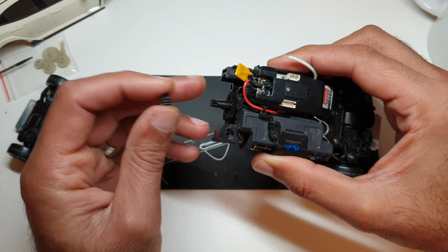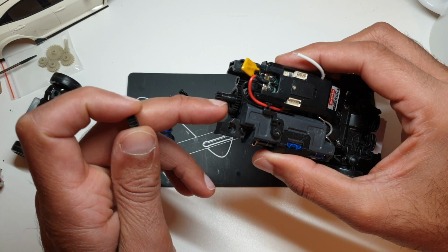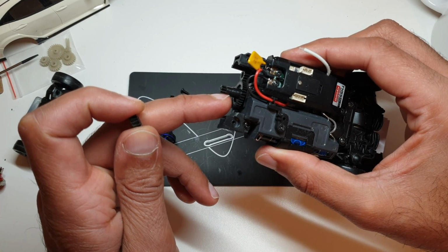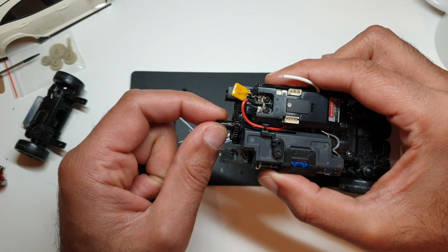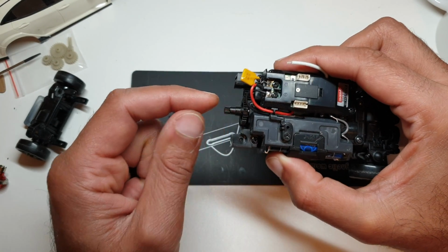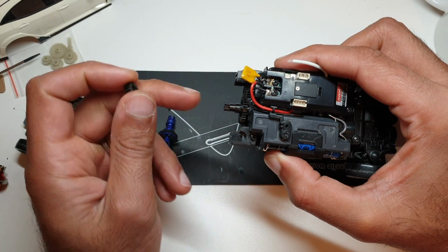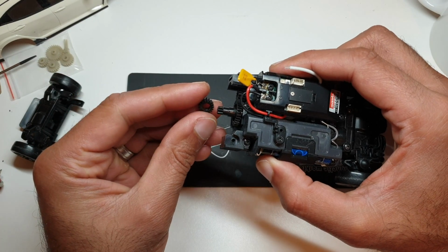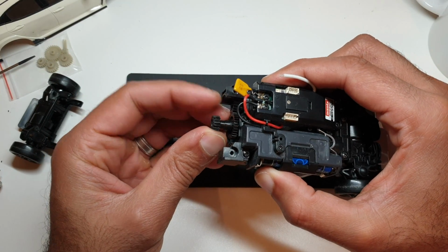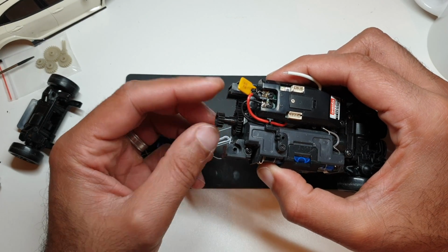The reason I wanted to fit over this main gear is I don't want to cut this gear off, because the axle that connects into here is what decides which engages the axle and makes the gear turn. If we were to chop this gear right down and try and glue this on, then the axle inside would spin. It's less work and easier to do if we can just get the gear to seat over here, because we'll know it's roughly the right distance and we also know that it will fit.